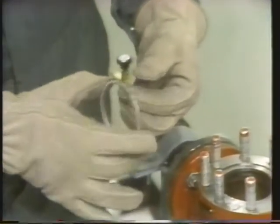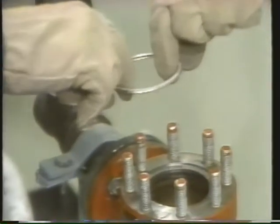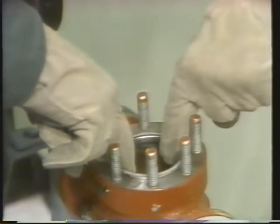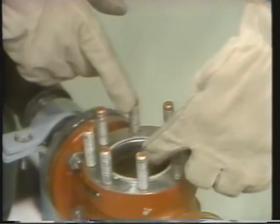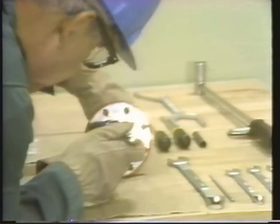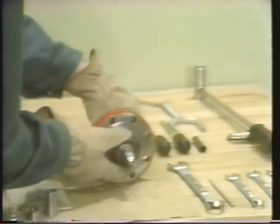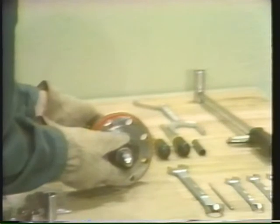The technician inspects the gasket to make sure it's not warped or dented in any way. The gasket is placed in the gasket groove and fits right into place. The technician gently presses the gasket down to make sure it's properly set. The next step is to reinsert the plug through the bonnet. The technician pushes the stem through carefully to avoid damage, pulls the plug back against the bonnet, and grasps the valve by the middle section of the stem to avoid damaging the threads at the top.